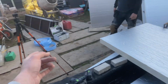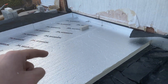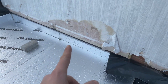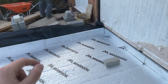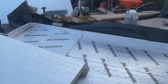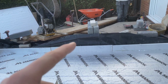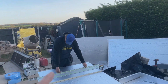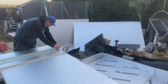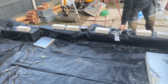So as you can see on the time lapse there, we have got the viscreen in and now onto insulation, but along the back edge, well around the perimeter, we put a 25mm piece of Celotex in to stop the thermal bridging, because that brick that goes around there is cold, this is going to be warm, it stops the thermal bridging between the two. Is that right? That's right. See, I know some stuff. Yeah, it's not making it damp, so...